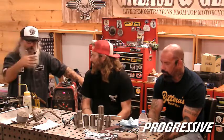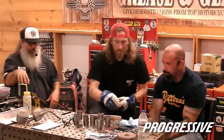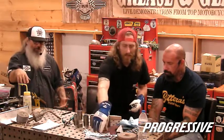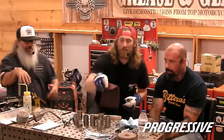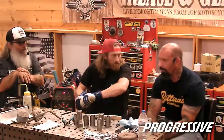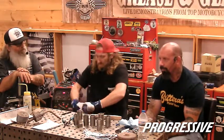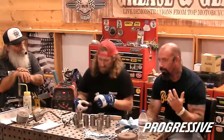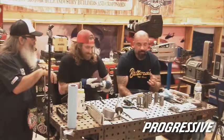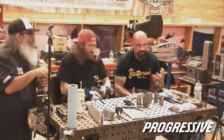Yeah. And that's what I was saying before about the heat. I know people that say they'll go with a bit of a lower heat and just mash the pedal all the time. And that's not a good process. No, because it takes longer in that spot. Austin and I had the conversation outside about that. If there's one thing problematic with getting your heat right in TIG welding, a common train of thought is if it's too hot or I'm burning through it, turn the amperage down. But it doesn't always work that way, because now you're staying in one spot to generate enough heat to try to melt it.